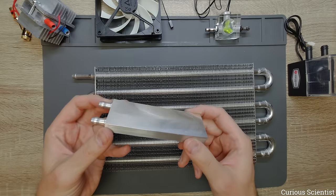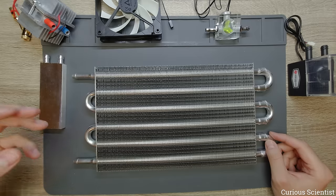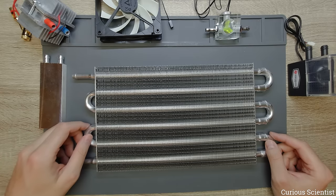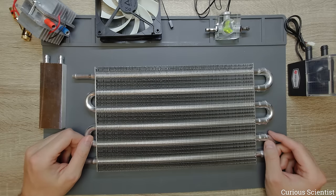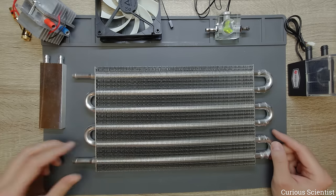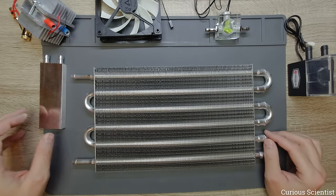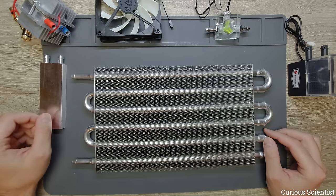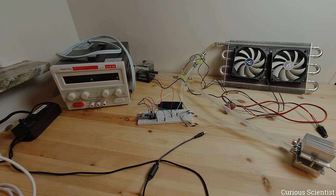You should check my other video where I was talking about the other water cooling system. I have a cooling block with four TEC12706 units attached to an even longer water cooling block with heatsinks, cooled with a water cooling system providing a cold surface on the heatsink. I will probably try that also with this system. I'll assemble everything, move to another table, and do some basic tests.